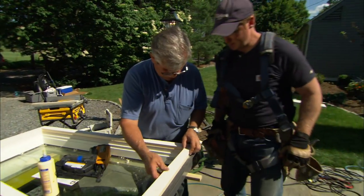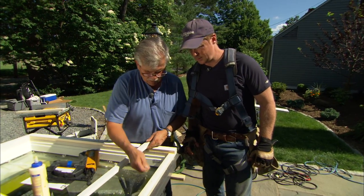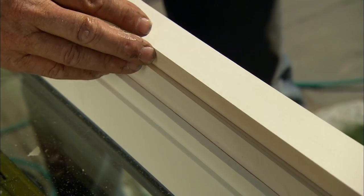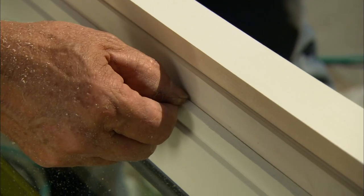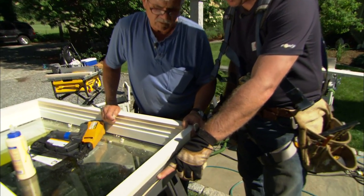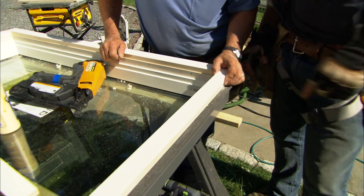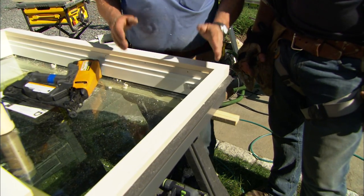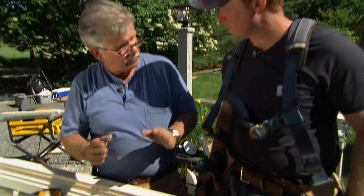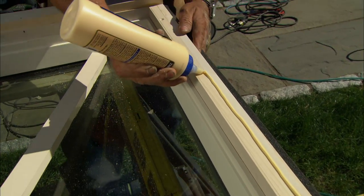This is a little piece of side casing that's going to sit right here on top of this filler that I made. I put a line here to set a little reveal, so it'll match the reveal down here. This is the finished trim that you're going to see from the inside of the house. I'm actually trimming the whole inside of the unit before we put it in place so I don't have to go up on a ladder. I'm going to glue it in and nail it.